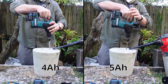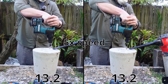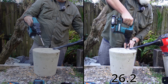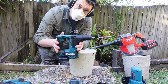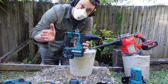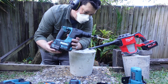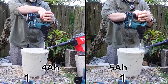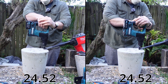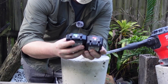Eight millimeters in concrete. That is a classic small rotary hammer problem — you're usually drilling small holes which don't have very much room on the sides; they go in really tight. Believe it or not, the tiniest hammers often need a bit more torque than you'd think. Just there, the 4 amp delivered more than the 5 amp. Now 12 millimeters. After all that, they are on three stars each.